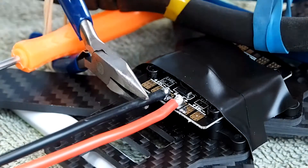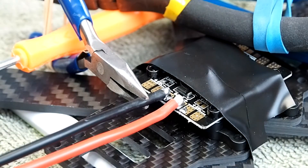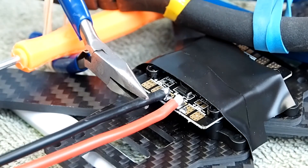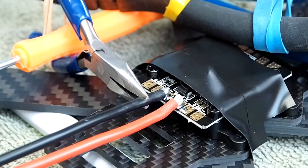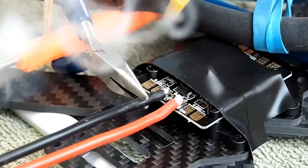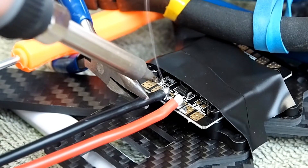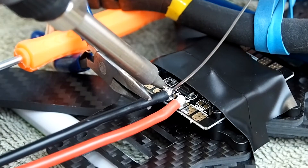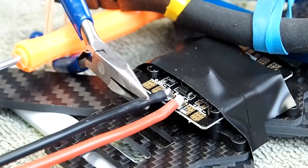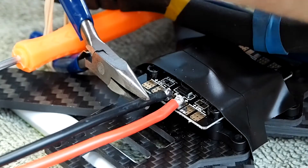We're looking good. Same procedure. Even though I cleaned the tip before I put it away, it oxidizes — gets a little grime on there. Clean tip. Negative ESC. I'm going to tin the tip of my clean iron, then clean it again. Clean iron. Good amount but not crazy. I'm going to bring my iron in at an angle, touch my pad and my wire, hold, feed solder, feed solder, feed solder. Boom. Perfection.